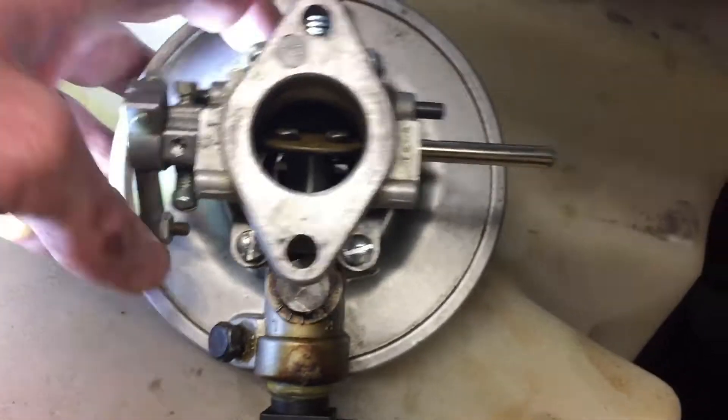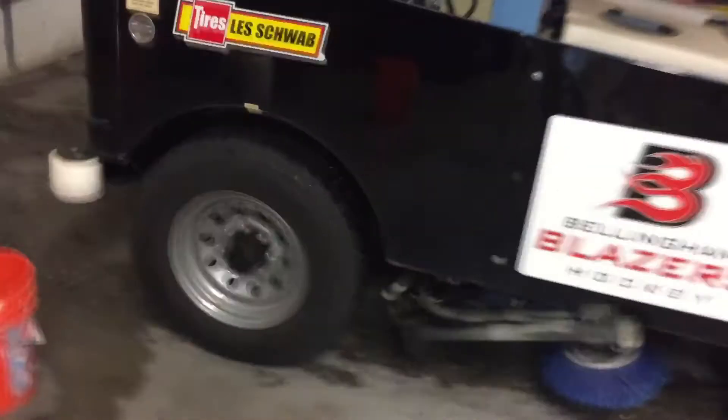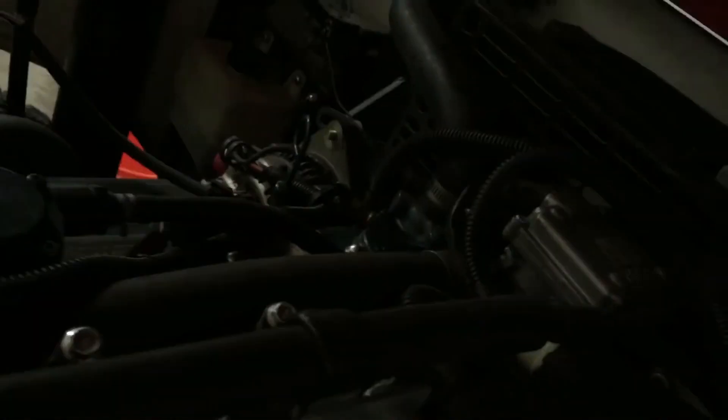This is essentially the propane carburetor, whereas the other machine has fuel injectors. Let's go back to that machine for a basic overview since it's easier to understand for people familiar with electronic systems. Once you turn the engine on, it electronically opens a valve that lets propane flow into the converter. The converter converts the liquid propane into a gas, which comes out via an elbow into the fuel injector rail.